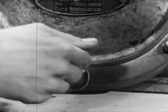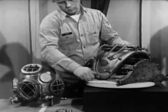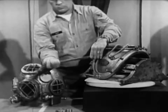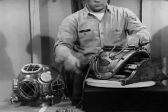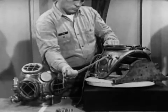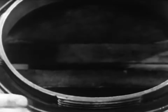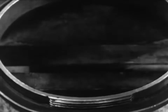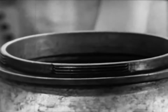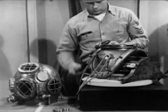Notice that four of the wing nuts have heavy flanges. These go on the studs where the ends of the breastplate straps join each other. Look for worn areas in the breastplate lanyard. If there's any doubt, replace them. Remember, these lanyards secure the all-important air hose and lifeline. The leather gasket recessed into the top of the breastplate makes a seal between breastplate and helmet. Make a visual inspection for tears in the leather and for cleanliness. Dirt or debris could prevent proper seating of the helmet, thus causing leaking.